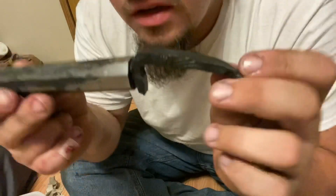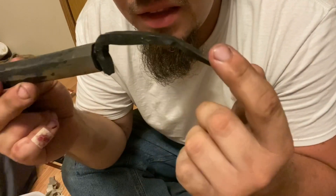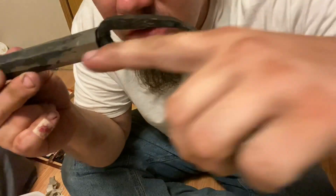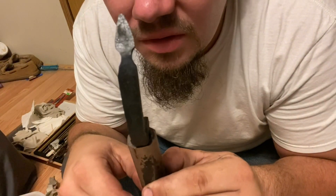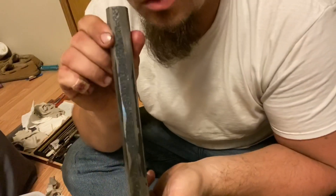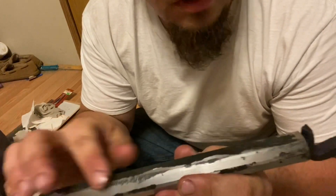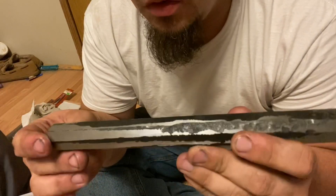There's still some gap in there so I'm probably gonna take this out and fit that back up. This is actually the third breech plug — I messed up the second one trying to fit it too. Those double ball double chargers had quite a bit of recoil to them. The tang was straight with some slight curve backwards, and now it's bent right at the finial neck. But the barrel is proof tested. I've decided to clean up the top five flats and leave the bottom ones rough, so it shows it was hand forged, and I'll be able to inlet into the stock just fine.